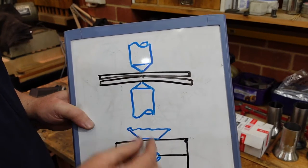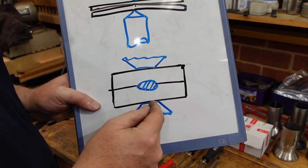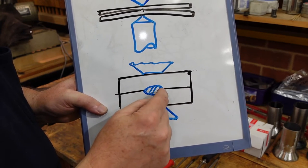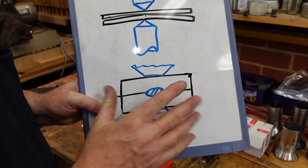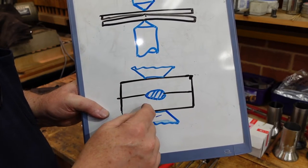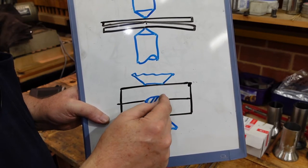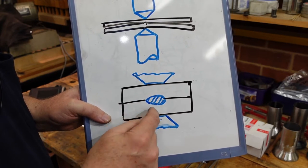What you're doing is basically this: you've got two bits of metal sandwiched between your two electrodes. The resistance between the metal interfaces is higher than the resistance within each electrode. Industrially they cool the electrodes down and all sorts of things; here we just rely on the resistance between copper and steel being less than the resistance between steel and steel. The combination of pressure and current is enough to form a molten pool — that's the nugget that you pull out during destructive testing.